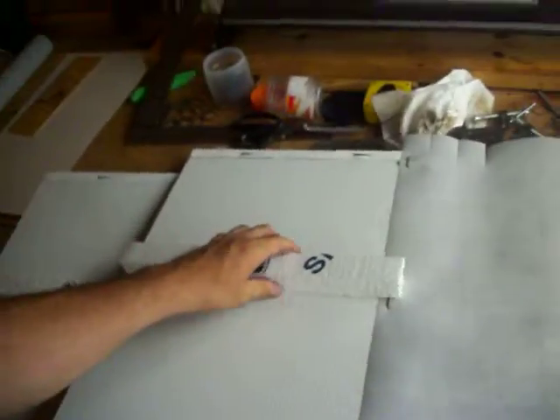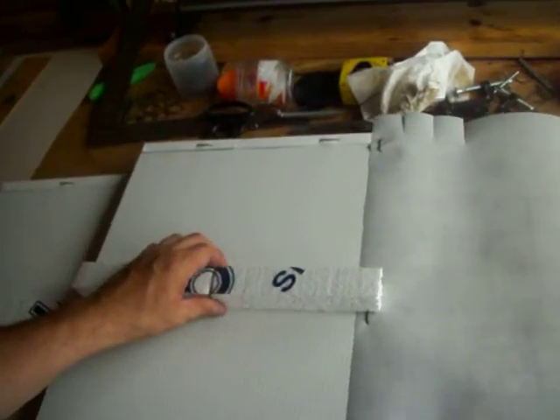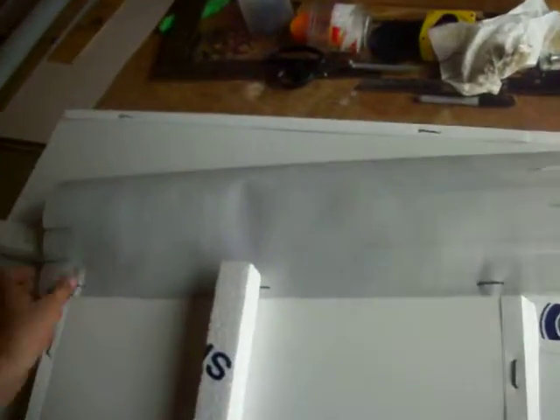There's another part of this which is the section that goes up next to the soffit vent. The reason I went ahead and did this is because this particular house has virtually no eave. To save money, builders are doing away with eaves, which is a mistake — the eave is like an umbrella: the bigger your umbrella, the drier your house and the less likely water is to get behind the siding and cause damage. Because there are no eaves, the roof truss comes down to right above the interior wall and there's very little insulation there, unless you do something to bow it out over the wall.